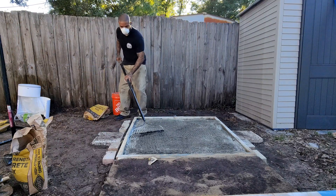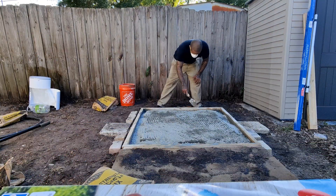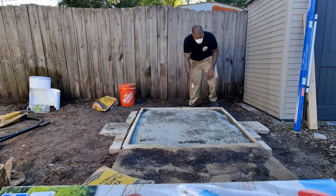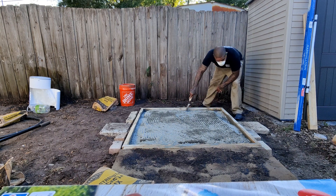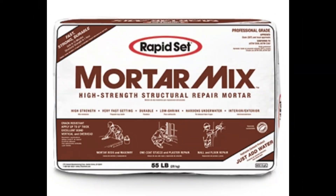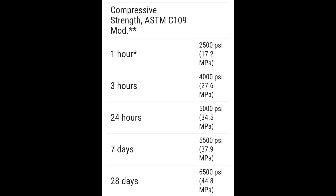What I ended up doing was laying it in different patterns. I put the dry pour down first, wetted the ground, put the dry pour down, wet it, then wedged in the concrete pavers to take out any extra air pockets. They wedged in with the dry concrete, I wet it down, then mixed up the wet pour and poured it in.